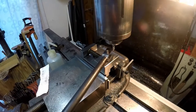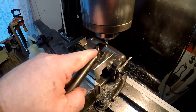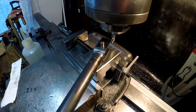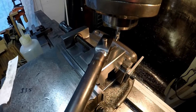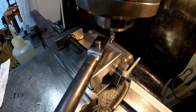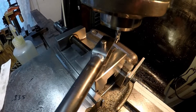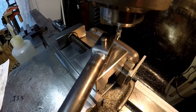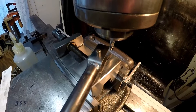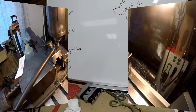What we have is a machinist vice clamped inside of a bridge port vice with a quarter-inch dowel pin secured in it, going through the quarter-inch bolt hole that connects to the airplane. We're basically going to feed the workpiece into the mill with the end mill turning clockwise — conventional milling, not climb milling. If you do this while climb milling, the tool is going to grab the workpiece and you'll ruin it, and you may end up hurting yourself. I'll explain that on the whiteboard in a second, then we'll start turning the radius.